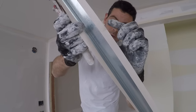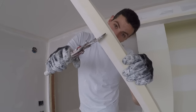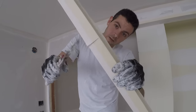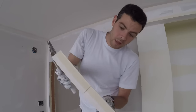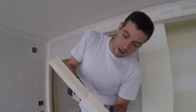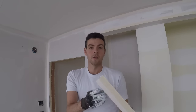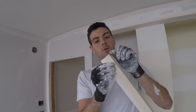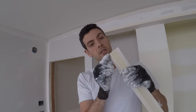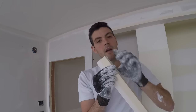What I did was I just snipped the paper really quickly so I could see where I need to cut. Now I'm going to eyeball a nice straight line right up to the corner, then go from this side and eyeball this line again. Here's a quick little tip: usually after snipping it, one side warps a bit — one side will stay straight and one side will be warped. So I'm going to bend that side back to where it needs to be. Or the other trick: flip your bead over and use the factory side on top where it matters.